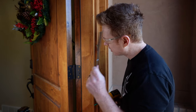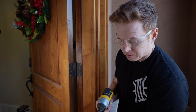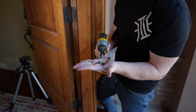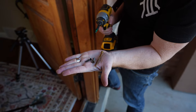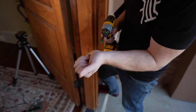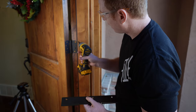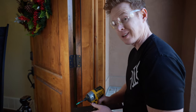I just took the Dremel and moved that hole over just enough to fit it in there. You can see the alignment right there. These black screws are the ones that typically come with a hinge when you buy it — about a three-quarter inch screw, pretty lightweight to hold a big heavy door under force. My old hinges had about a one-inch number ten screw, but we're replacing them with these tempered steel three-and-a-quarter inch GRK construction screws. These screws are going through the hinge shield, through the hinge, and into the jam — four total, two of them going through the hinge.